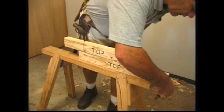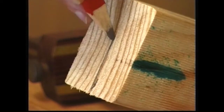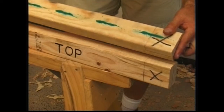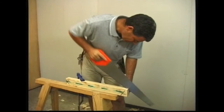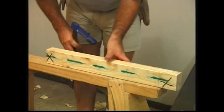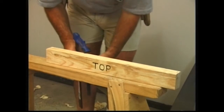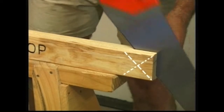The waste is removed. Ripping with the grain is done first to avoid splitting. By ripping at an angle of 45 degrees, two set out lines are visible to guide the saw. When the first 45 degree rip is made, the timber is turned and the process repeated, finishing the rip accurately with a vertical saw cut. The waste is removed by cross cutting down to the rip.